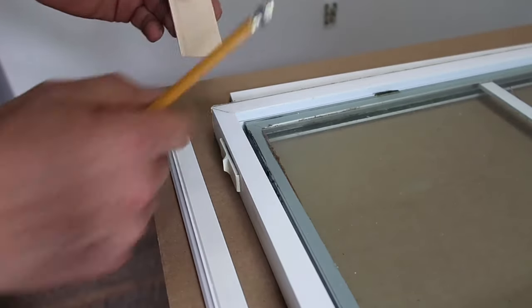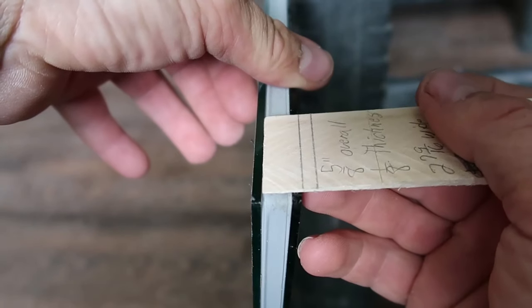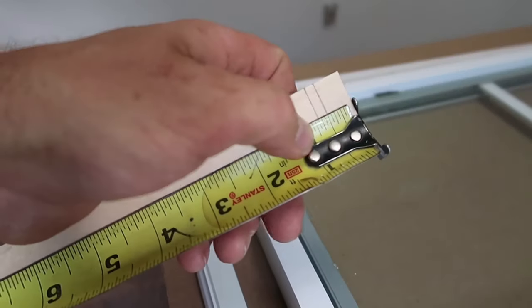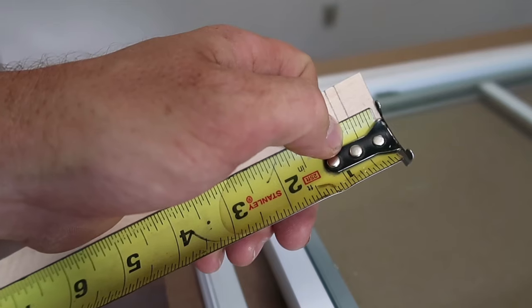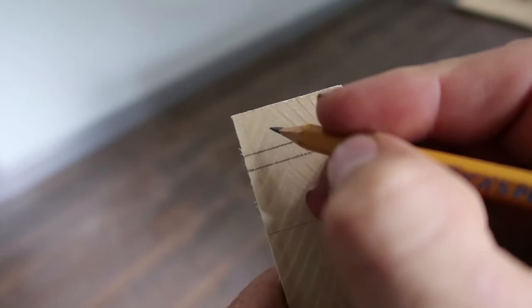Once the strips are out, the next step is to measure the glass thickness. I'll take a wood shim with a straight end, stick it down between the glass and the frame, and put a pencil mark. Then I pick it up a little and feel where the inside of the glass pane is and put another pencil mark. I pull the shim out and measure those marks. The first mark is exactly at a half inch, the second at 11/16. There's about a 1/16-inch of adhesive on the other side, so dropping that gives 5/8 inch — meaning the overall width of the double pane is 5/8 inch and each glass pane is 1/8 inch.